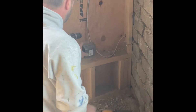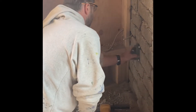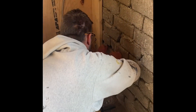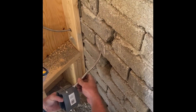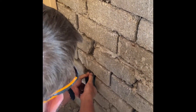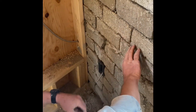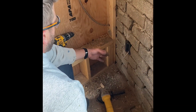That's probably pretty well ground out. I'll probably end up using a metal box, but I'll use this plastic one for demonstration. I'll be able to put this in, prep it, and mount it. Then we're going to ultimately clean up this wall — we're going to point the joints, and once you put a regular cover on here it'll look pretty nice. So that's one way of installing an electrical outlet into an earth block wall. Thanks for watching.